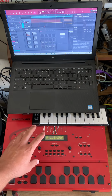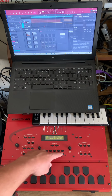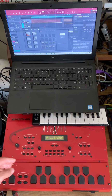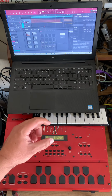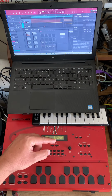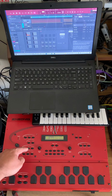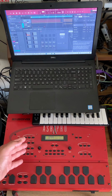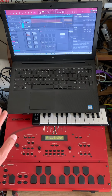The other big thing with this is build quality, right? These tend to go bad, and so they need to be replaced at some point. The screen is good. These buttons are really finicky. They have these little tact switches and little plastic posts that ride the tact switches up to the surface. If you press these too hard, you can break that post and you'll lose a button, right? And you'll often see these in the used market missing a button or two, right?